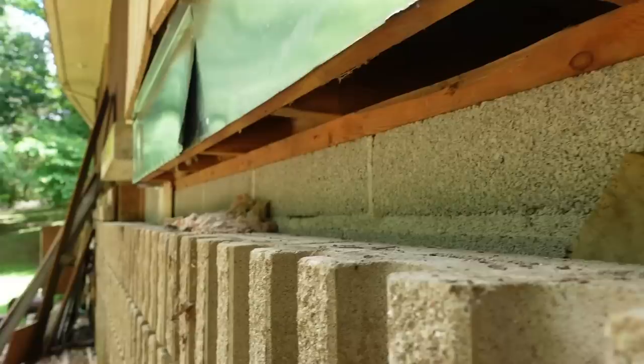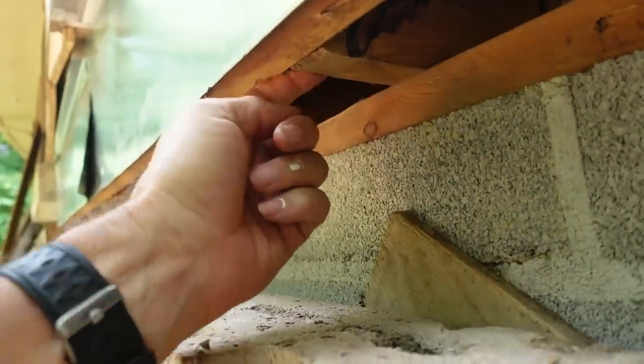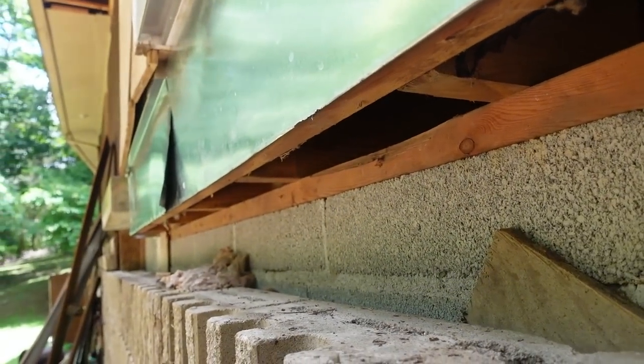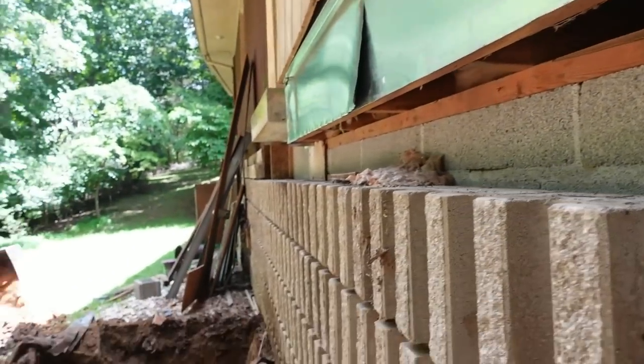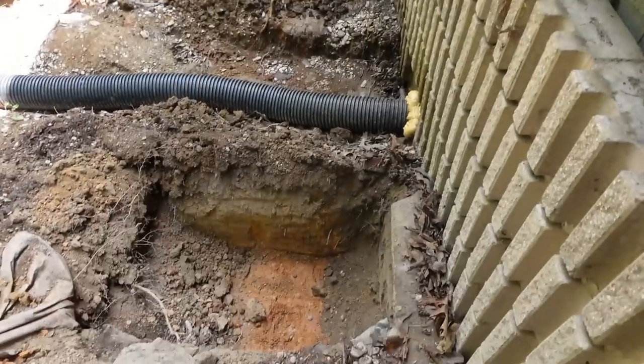We had a problem here. We got to do three more. The problem is the house is cantilevered. The house itself hangs 4 inches past the foundation wall, and he said you cannot attach a deck to a cantilevered wall. We didn't know this. So he said we have to build the deck freestanding.